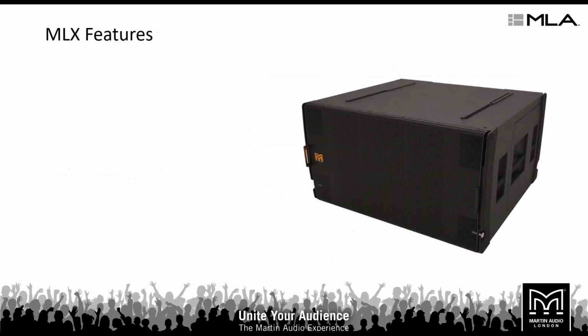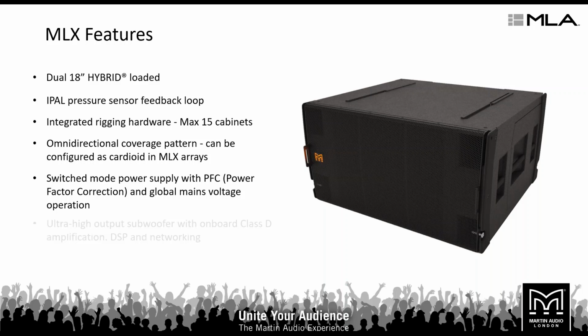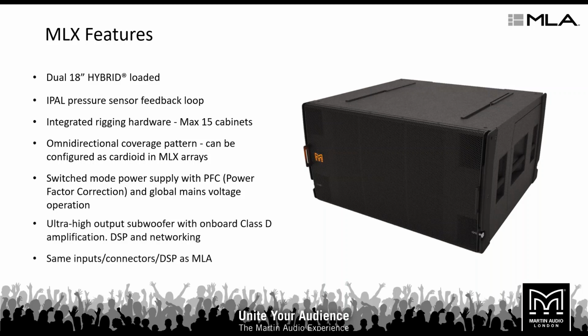Moving on to the MLX, which is the sub which complements this system. This is a dual 18-inch hybrid. This also has the iPal technology in the back of the amp unit. This actually allows us to monitor what is going in and what is coming out at the same time, and therefore make electronic adjustments to the parameters to make sure that no matter how much power you're using, so low levels or high levels, you're getting the same musical output that you would expect.